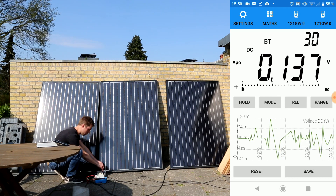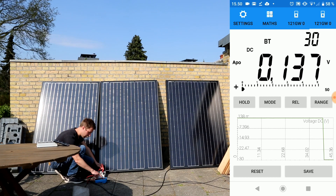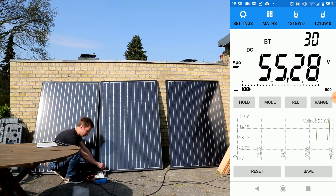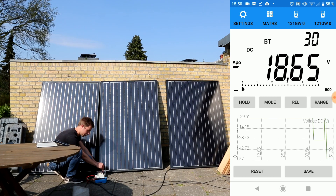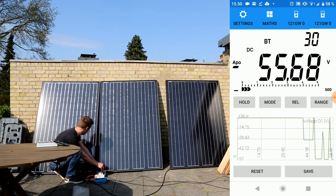Taking the first panel — getting OFL, adjusting the range. Here we have it: 55 volt DC. And we have 55.9 on the second, and 55.7 on the third.